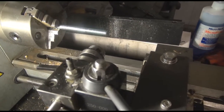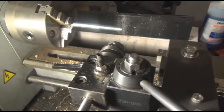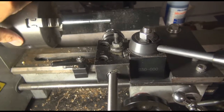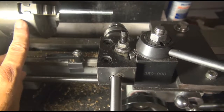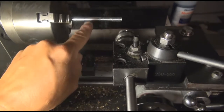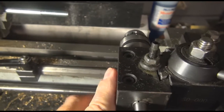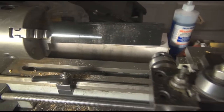It gives you a little bit of clearance so I can put a bit in now and use it to line up with the stock. I will show a clip of how I squared this off really easily — it's a little bit simpler than most people would do. I just line the square up to the side of the chuck on the other part right here, and then it gives this completely square to the work. You can also back this up and run the square from here to the work and do it that way.